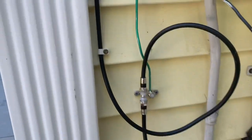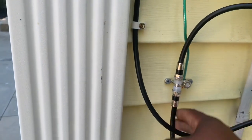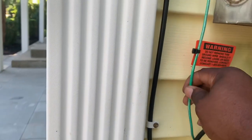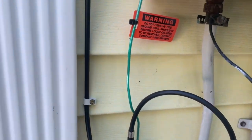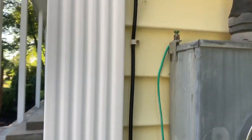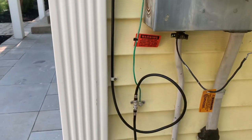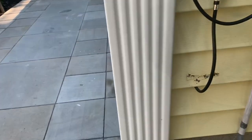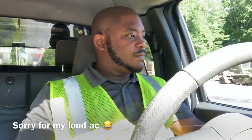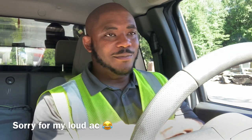Finishing touch — new ground block. Drops right here, wire going inside the home. New ground wire with the ground tag; I gotta cut the old tag off. Grounded to the meter here, that's it, we're all set. Just gotta finish making the connections inside and it'll be good to go. Alright guys, just finished that job — customer was excited, got everything hooked up, everything's up and running. On to the next one!